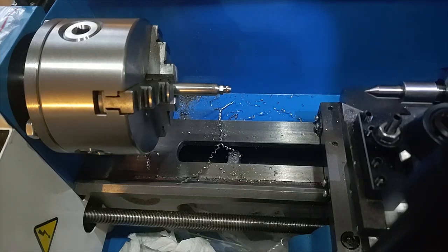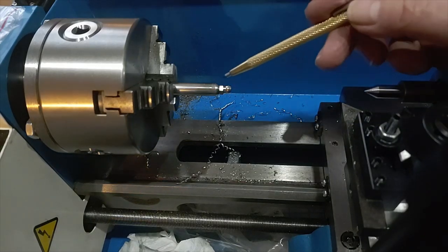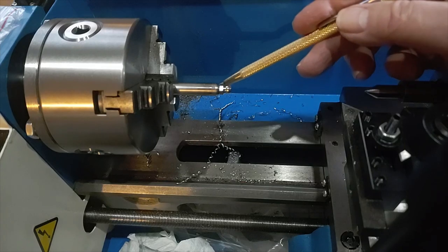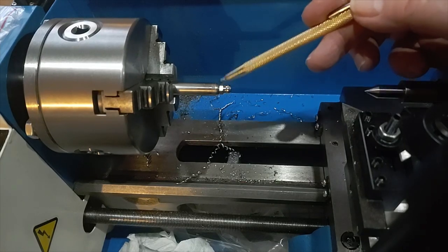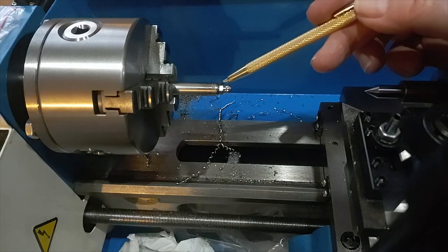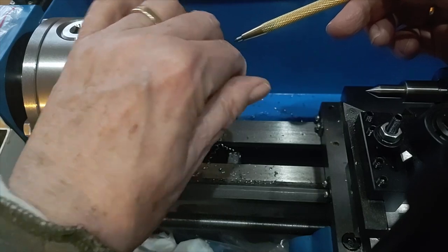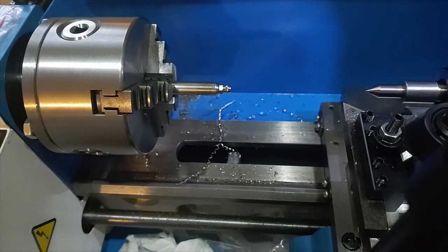And this is the end result. When all is said and done, there can be only one. You will not have the zerk in place. I'll make sure everything's settled in — I don't want to put a ton of pressure against the zerk. But that's what we're going to be doing. This allows us to add grease to this over the years and help keep the crud out of those very, very tender little plastic inserts on those bearings.